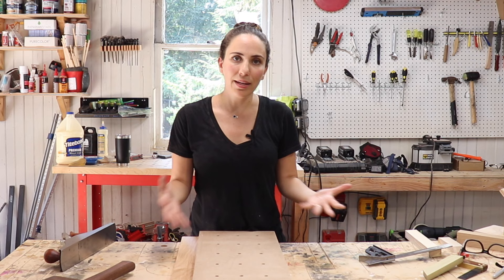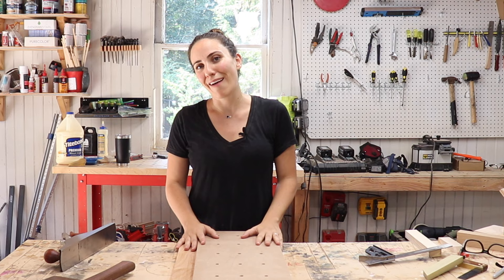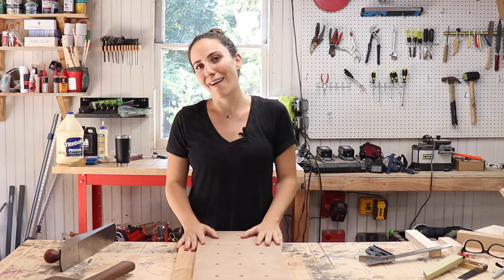That's all the attachments I made, but what's really awesome is I can make any attachment I want. If I'm cutting something at a different angle, I just cut a piece of plywood with that angle, cut the same half-inch groove, and stick it onto the existing shooting board. There are a lot of possibilities here, and I'm really excited to up my hand tool game. Thanks so much for watching — I'll see you on the next project.